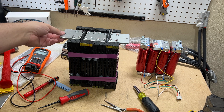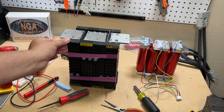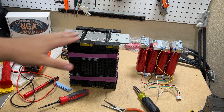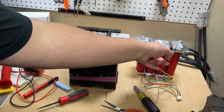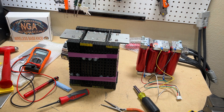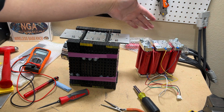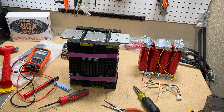The pack is assembled and as you can see these bus bars are far from perfect — if you're doing it DIY it's going to be hard to get really nice looking bus bars unless you have access to the right tools. I still need to put in my compression and put it in a case. If you want perfect bus bars, plenty of people make them and in my opinion they're very affordable. I recommend Project DB — these are some of the only bus bars I've bought online and I'm very happy with them.